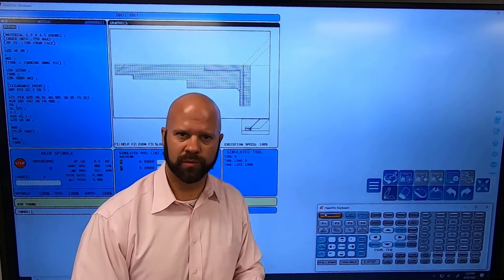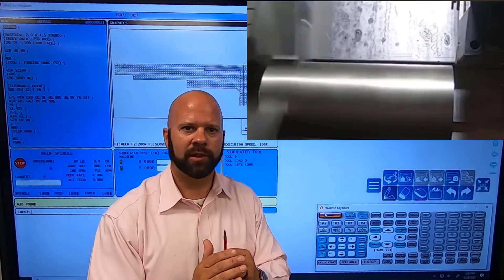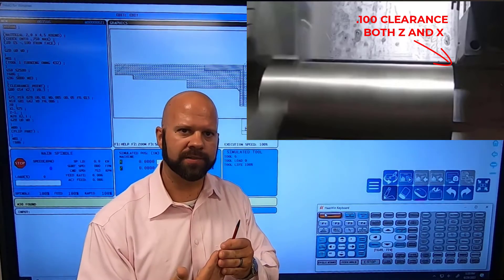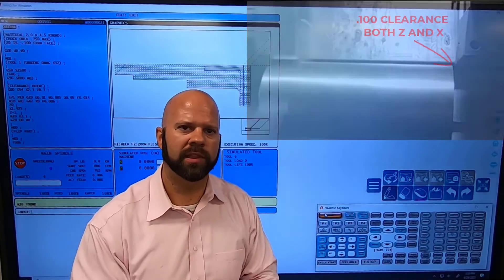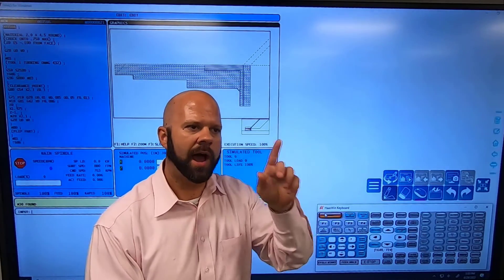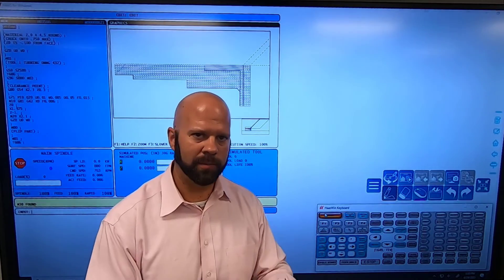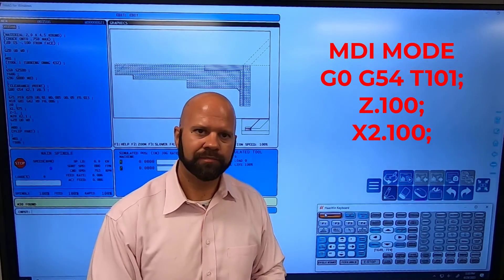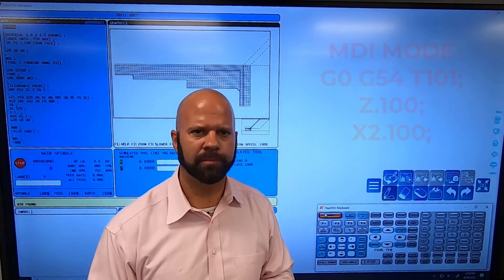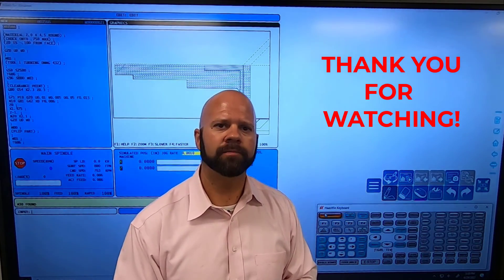Just to wrap up: my clearance point is up to you to set in a safe zone. The rule is one hundred thousandths bigger than your raw material diameter, and one hundred thousandths in front of your material in Z. Because even if you shift your work offset, you're going to have to offset your clearance point the other direction so that you don't crash. If you come in a hundred thousandths with your work offset, go a positive one hundred thousandths with your Z clearance plane. Remember, you can always type in MDI where you want that Z position to be to verify your clearance plane is clearing the part. It might take a couple of times for this to sink in. Thank you for watching — my name is Aaron Runk, I hope you enjoyed.